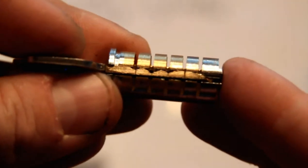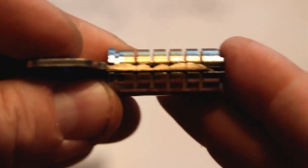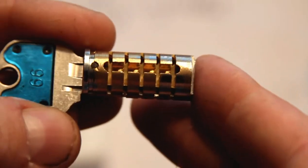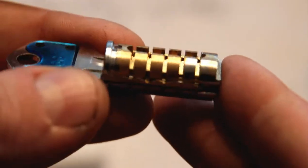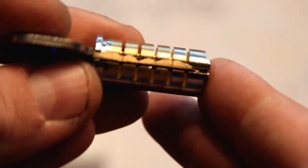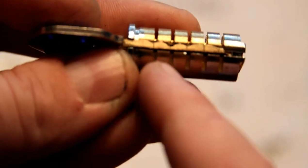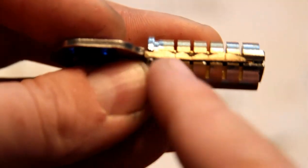This may be clearer if I stick it into a plug from one of these guys. You can see that these cuts line up with these little slots that are milled in the side of the plug. Those interact with little levers, which interact with a sidebar providing a secondary locking mechanism, which gives this one of the properties you probably want in a high security lock.